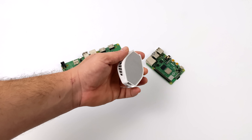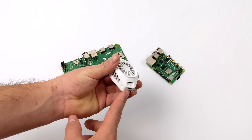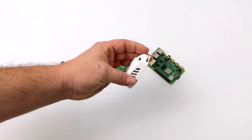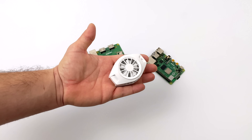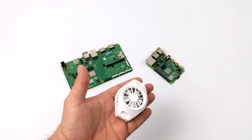When it comes down to it, the way this works is you plug electricity into it, one side gets really hot, one side gets really cold. As you can see, this does have a fan and heatsink installed on it because that heatsink gets really hot, but the bottom side gets super cold, and that's what we're going to be mating up against the Raspberry Pi CPU.